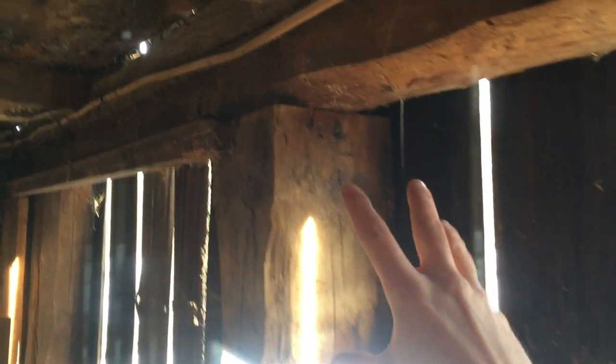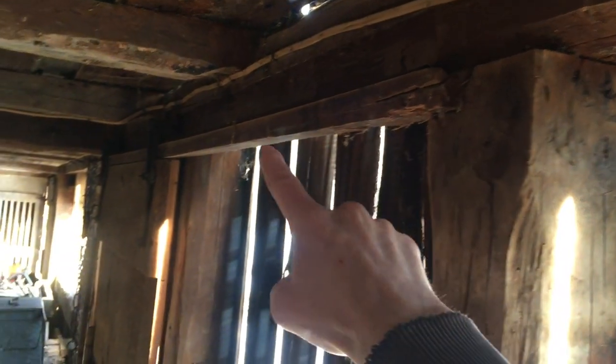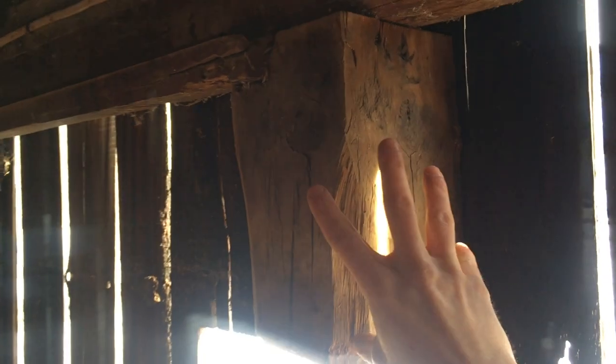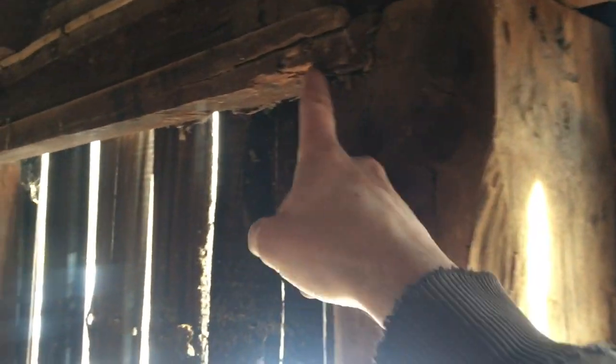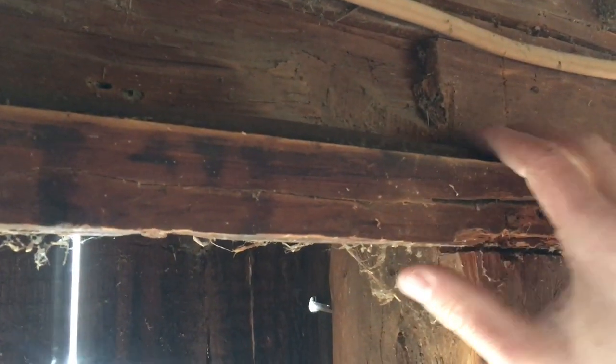The way the lighting is with the sun outside reflecting off the snow, it's very bright in contrast with the darkness in here. It's a little hard to see, but this is a six by six stub of a block, and that right there is actually the track for that sliding door. This was held up basically by the two-by piece that was running the top of this window. And otherwise it's just kind of barely spiked up top here, but it is carrying load. This is notched in and then this is the door track right up in here.